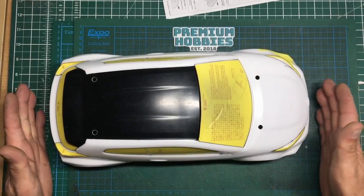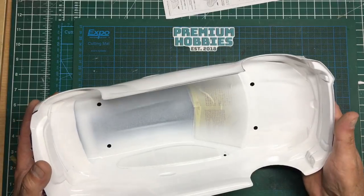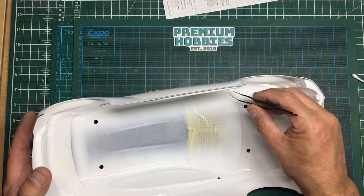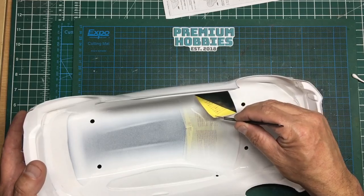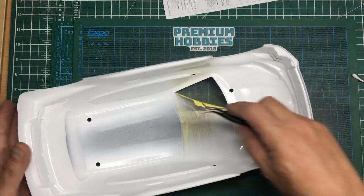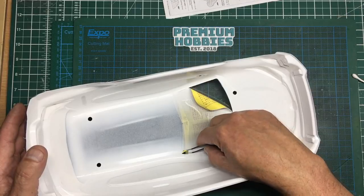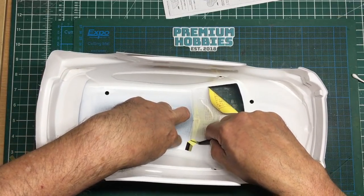And there we go, guys, back in the house. Paint's dry, doesn't smell anymore. So I'm gonna get these window masks off. Remember what I said before, best to get the masking off while the paint is still soft before it's gone hard. So don't leave it overnight, and you're less likely to peel then. So I'm also gonna carefully remove this masking tape here, because some of this has gone onto that black. Just going to make sure we don't get any peeling.